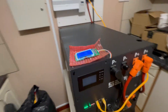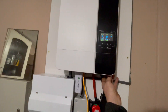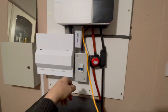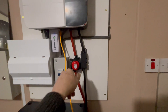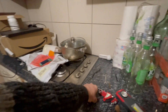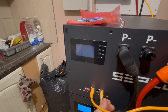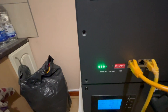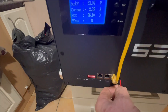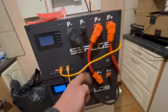So I'm going to change them both now, strip them down and get them installed. First things first, switch my inverter off - that's switched over to the mains now because I've got that contactor in there so it automatically switches over. Switch my batteries off, and then I'm going to hit the reset on these to shut them down - shut that one down and shut the bottom one down as well. Wait till they shut down, take the plugs off and everything.